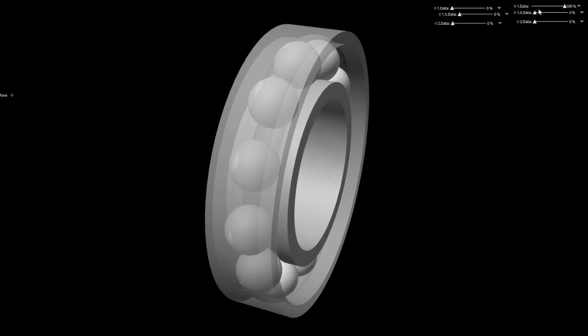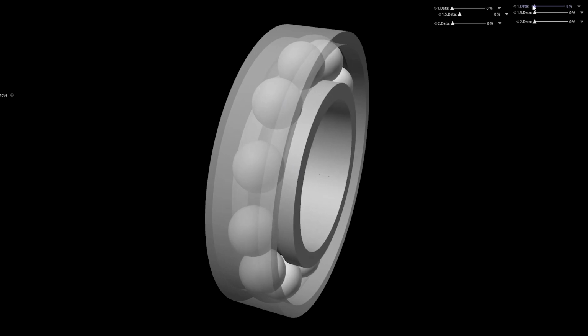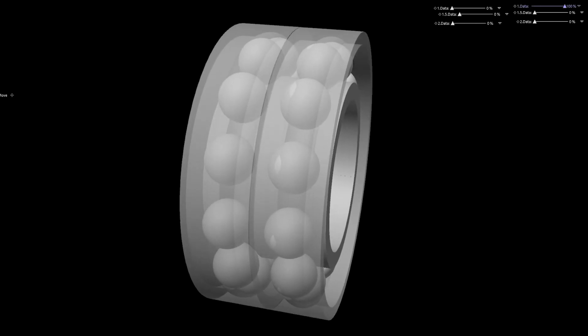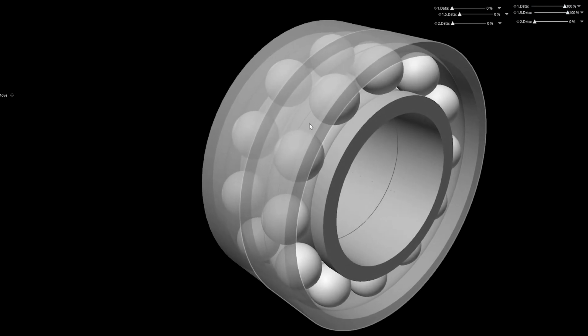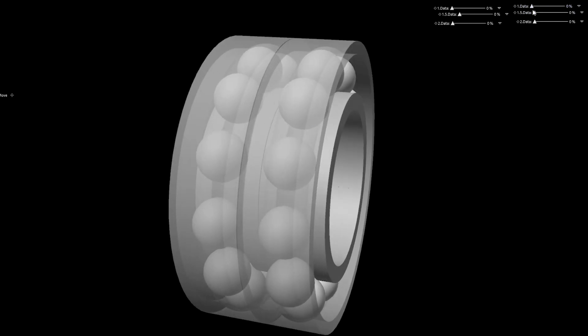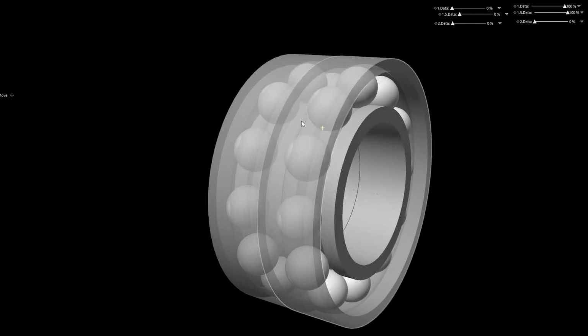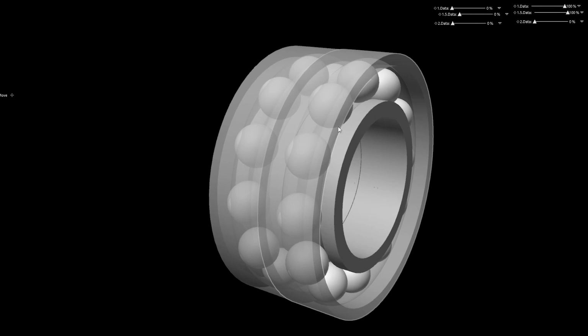So in the case of our double ball bearing bearing block, we have a second ball bearing here, and literally the same thing happens when you apply a load in one direction. Both the inner races move in the same direction, and the only thing that is beneficial here because of that second ball bearing is the force. The deflection is basically halved, isn't it? Because the force allowance is increased before you see a measurable effect. So it's kind of just like safety by numbers, really, that kind of approach. It's not ideal, especially in high load scenarios.